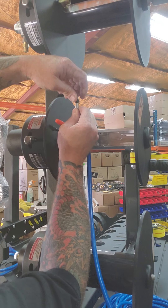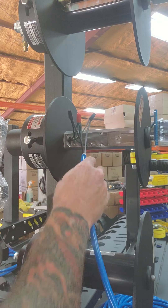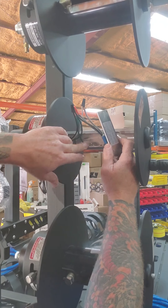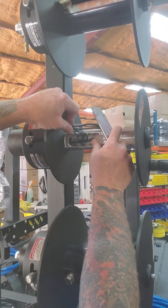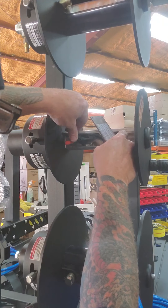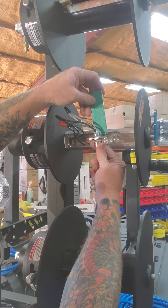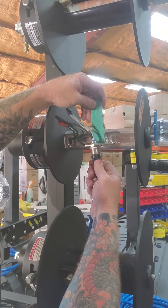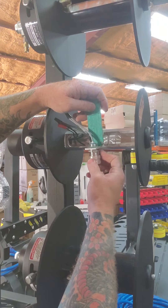Gray — or whatever they're calling this white — white to white, that's what it is. Don't let my sarcasm get you wrapped around the axle. Boom. Now let's take our stuff and move it all up the line. This is where you have to play with things a little bit. Depending on the setup, here's the secret: you want the end of your jacket, once it's all said and done, to be compressed right there. Push your rubber stopper in, pull your cord back, take it right to the edge because when you start tightening this up it's going to come out a little more.